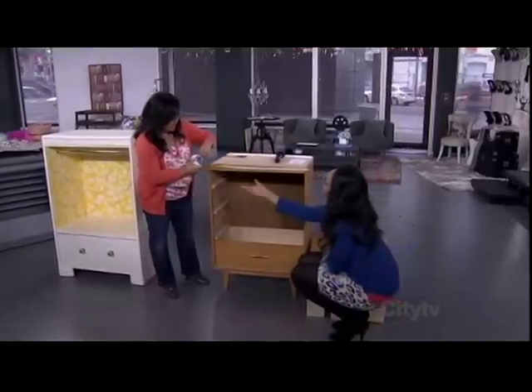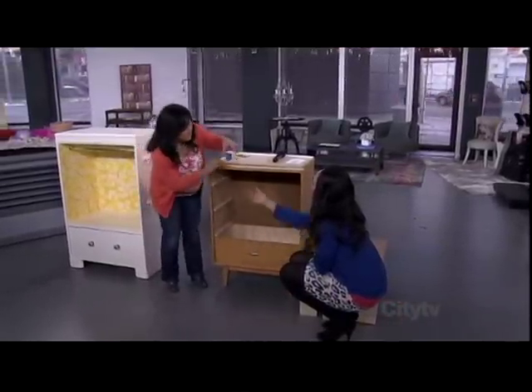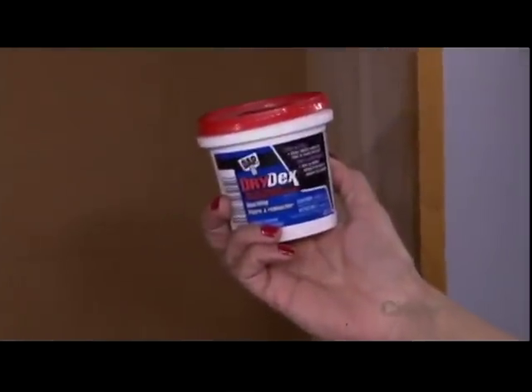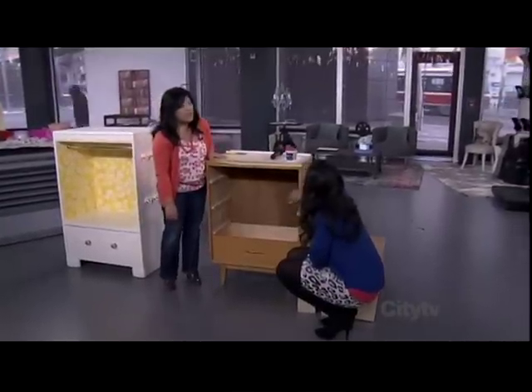How did you do the patching? You're going to use a spackling compound — this one is called DAP. Very easy. It goes on pink and dries white, so you'll know when it's done. We'll show folks what that looks like. That's fairly easy — not a lot of time. You apply that, let it dry, and then you move to the next step.